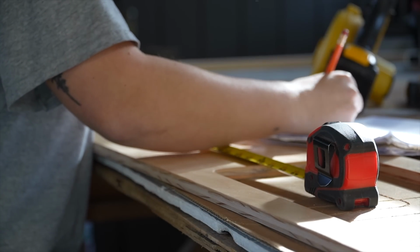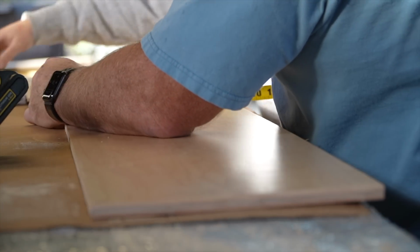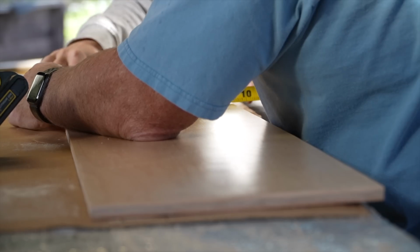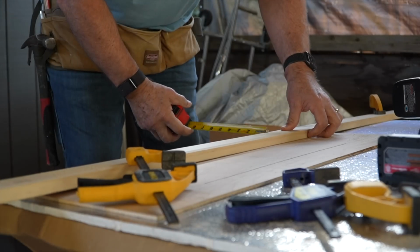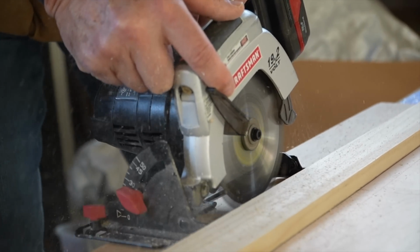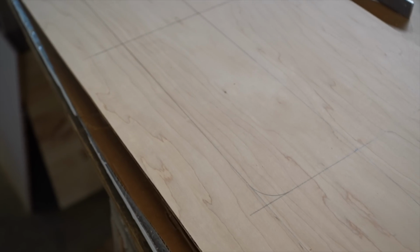This allowed us to be really precise, but it did take a lot of time and multiple passes for each door. So honestly, doing one cabinet took most of the afternoon. Because not only did the actual process of routering these out take a long time, but honestly, the most intense part was pretending we were a machine. We had to make exact templates for every size cabinet that we made, which took the longest time of all of the steps, if I'm being honest.